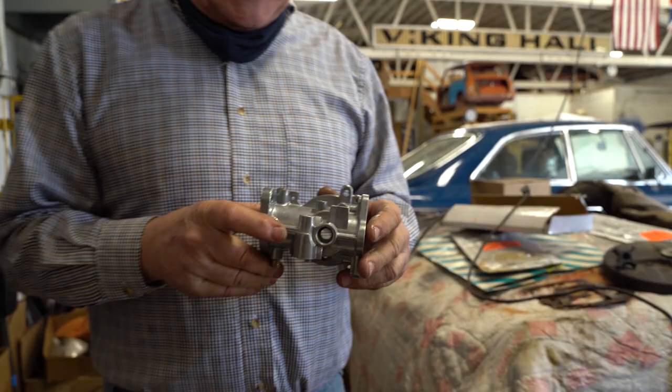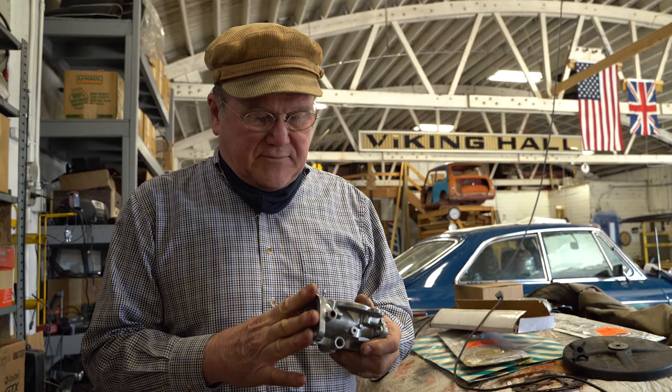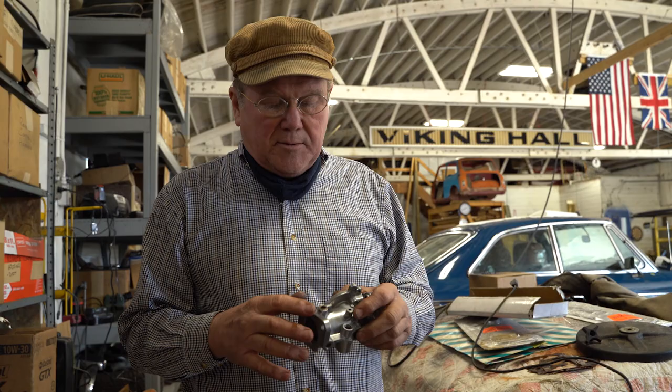I know other people use different techniques — there's a guy here in town who used something about soda or vacuum. Joe Curto does a different method. But this comes out looking really nicely. I showed you how, using the proprietary reamers you can buy from Curto, you ream this thing out and put the bushings in — either the bushings that come in the kit, no problem using those, or I like these because they're a little longer and you can space them just a little bit better. I do have to file them to make them absolutely smooth again.